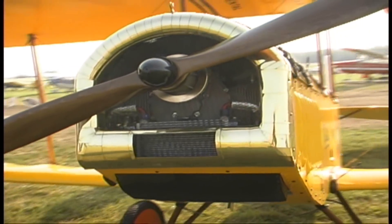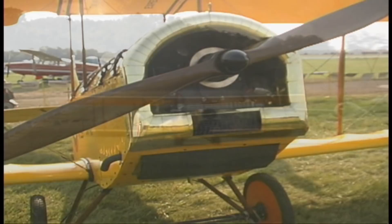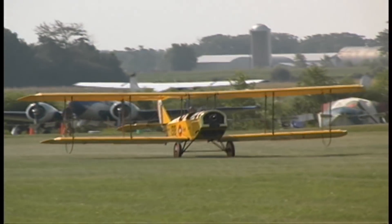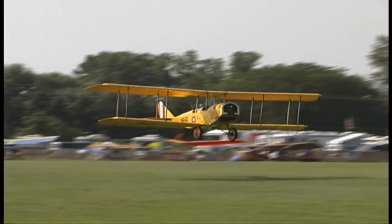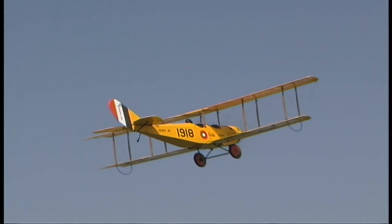What kind of climb rate do you have? The climb rate is right around 500 feet a minute. The cruise speed comes in at 60 to 65 miles per hour at 5,000 RPM. What's your approach speed for landing? I like to come in at 50 and it'll stall at 36 miles an hour. What type of control system is used? Just a conventional stick — I've got dual controls on it.